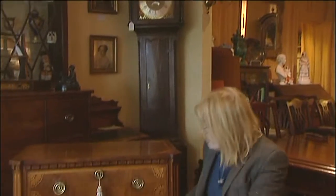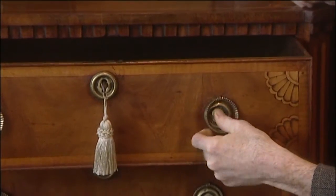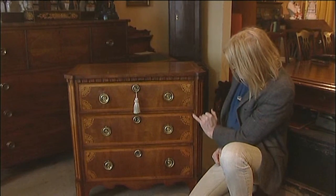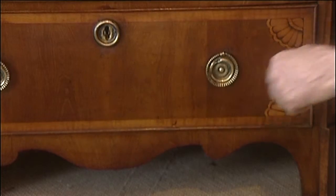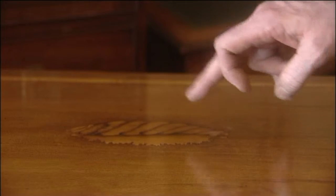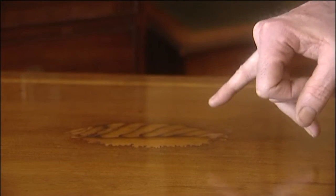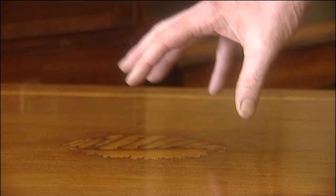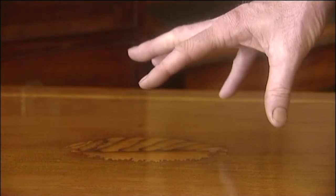So we've got the chest of drawers finished — as finished as I want it to be. The drawer runners have been replaced so it runs really nice and smoothly now. The beading's been replaced, and various bits of veneer that were missing. As you can see, with the central shell motif, it's been repaired rather than being replaced. Replacing something like that, in my opinion, is changing the look of it. It's too big a restoration.